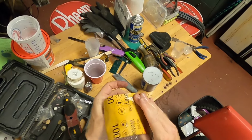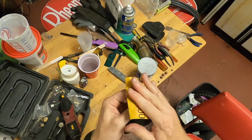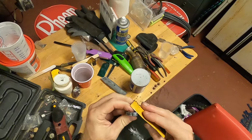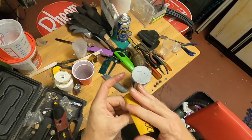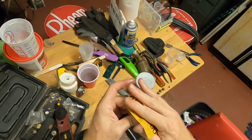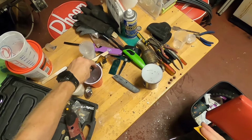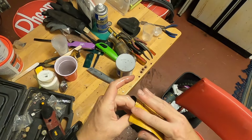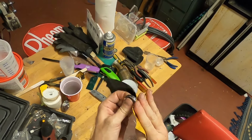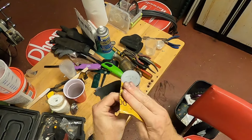I love that hammered edge look. I'm supposed to say fight, fight, fight around the edge. And that didn't come out. I think that was partly the blame for when I used the compressed air to blow out the inside of the mold. I'm thinking, y'all, that I need a different burnout resin for the printer. Stuff I have from Anycubic's not quite good enough. There's other types. I don't have to use Anycubic photopolymer. I could use somebody else's.